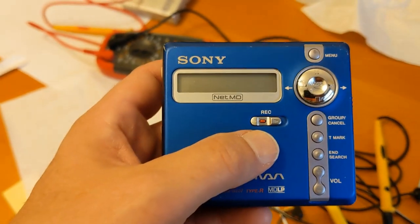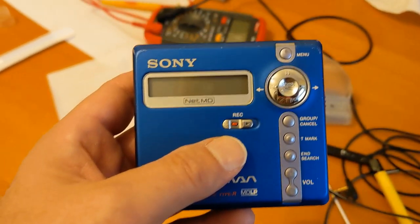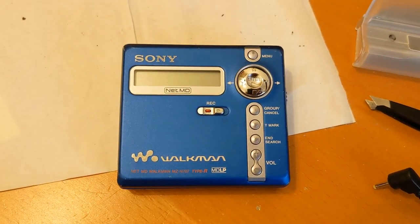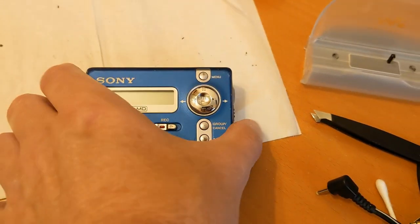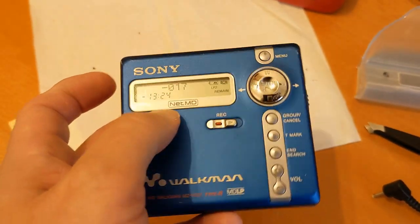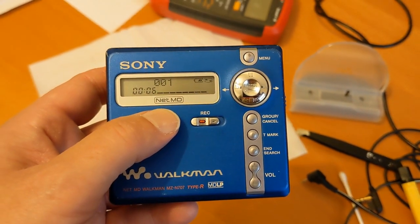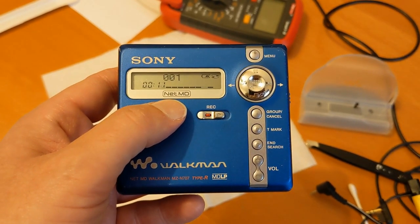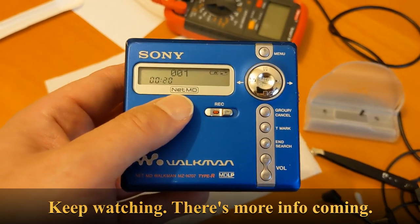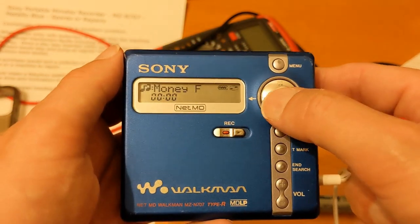What a complete nightmare that was. I'd unplugged my external mic from my other phone for the last part of the video, and then the phone ran out of space. It's just getting too complicated to do these long video fixes. But having put it back together again, it did come into life a few seconds ago. Here it is - I think it might be a problem with the eject mechanism, but it's now working. I'll have to give it a good test. I don't know what it was that fixed it - I don't think it was the corrosion because we had continuity on that. It could have been something that just needed a good knock on the back of the unit, or it could have been reseating all those ribbon cables.